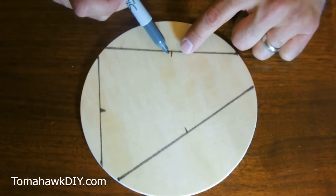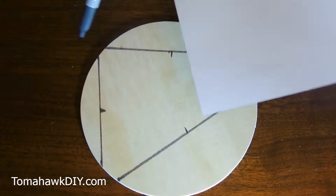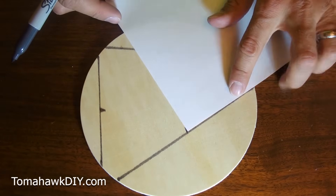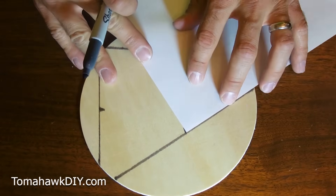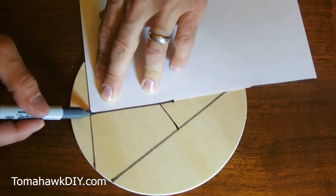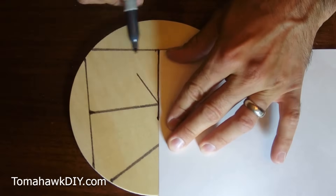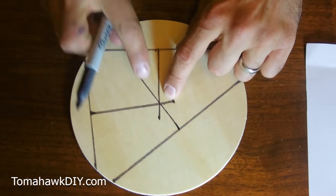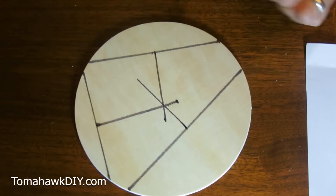So now we've got to draw 90-degree angles from each of these three midpoints. You could use a square to do that, or you can find anything that has a square corner. In this case, I'm just going to use a piece of paper, because that's going to give a nice 90-degree angle. Do the same thing over here — get my 90-degree angle — and that should be our center. 90-degree angle over here, and there we go, we got the center. We could have done that with just two chords; the third one is just a check to make sure they all come together nicely. Thank you Sooner Science Nerd.